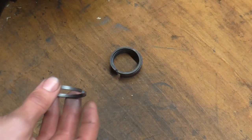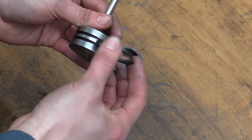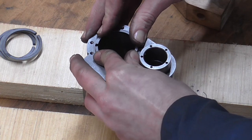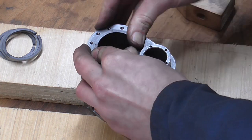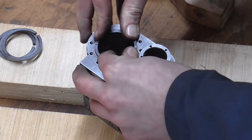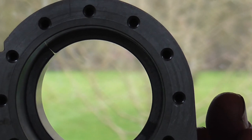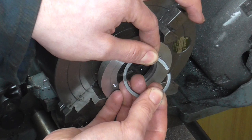They looked fine to me, however there were problems ahead. All I had to do was put the ring on, but disaster — I could not get the rings to go into the bore. This was a real challenge; I had to go away, stop what I was doing, and do some research into the field of piston rings. I eventually managed to get one piston ring into the bore but it was not satisfactory — far too strong. The ring needed to be weaker because it was exerting too much force. Also you can see daylight — the rings are not round. So problems with the piston rings.